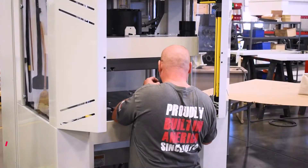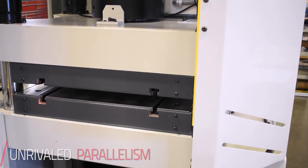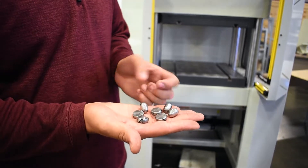Under normal testing, we hold one and a half thousandths per foot flatness with parallelism between our platens. We actually crush metal in the press to test the thickness of it afterwards and verify that that parallelism is holding throughout the pressure ranges.